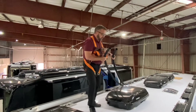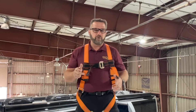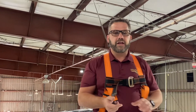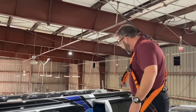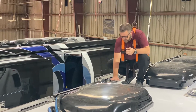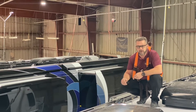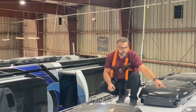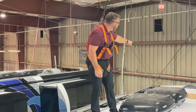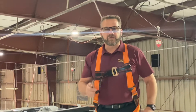Right here we've got these two big lines — this is intake and outtake for the radiator. We put the generator radiator here on the roof for a couple reasons: one, free real estate — it's up here and out of the way so we don't have to tie up a bay. Second, you get all the heat off the radiator up here — it's not blowing out underneath the coach with fumes down below. As well as our AquaHot and generator exhaust up here. I showed you inside the coach where those pipes were coming up through — right here is where they are on the roof, and they'll dress these out and put nice chrome tips on them. We also have the vent fan for the private bath and back there in the back of the coach the one for the rear bath. The guys are making great progress.